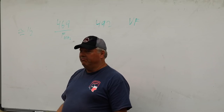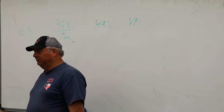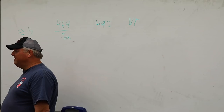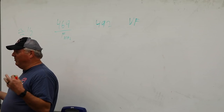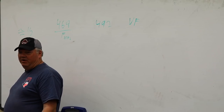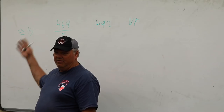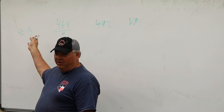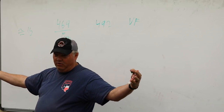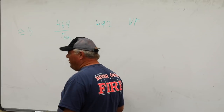So what's 300 divided by 3.5? Who did 85.71? It's about 80 meters. Yeah. So there you go. You take the 300 divided by that, it brings it down. So the 80 meter band, that's about how big the wavelength is. We're not going to worry about any of that, because they already figured it out for us.